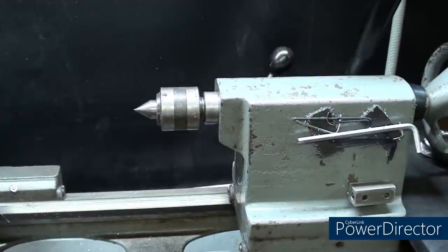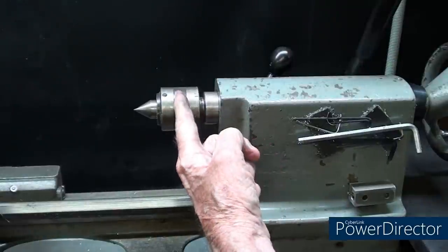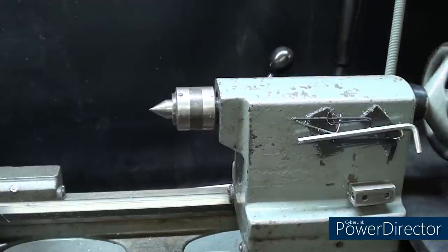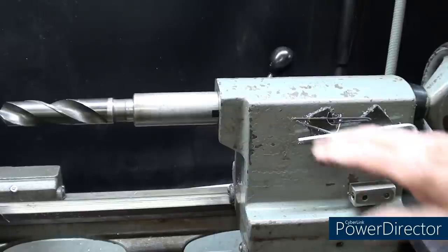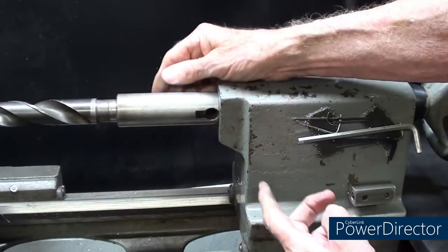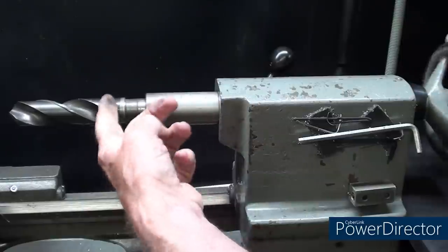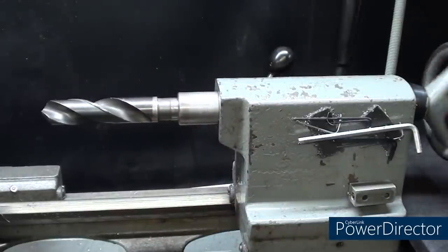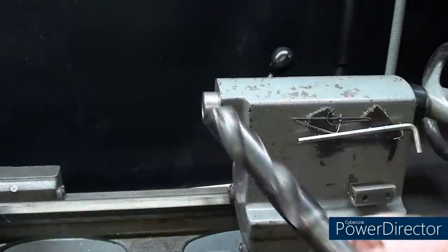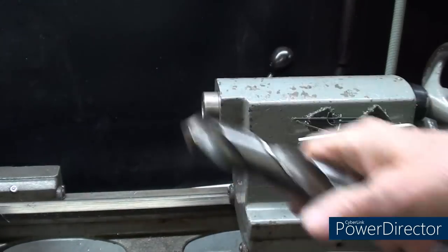One viewer said: if a tang is necessary to eject a drill from the tail stock, why didn't they put a tang on the end of the center? I can't pull that out, but I simply back the hand wheel out and that will eject it. So now I have a big drill in the quill, but you have to take the quill all the way out to put a drift into the slot there. To remove this large drill, you do not need to use the tang — you just back it up and it will eject itself. Everybody knows that, so there is a little bit of a contradiction there as to the purpose of the tang and the tang slot.